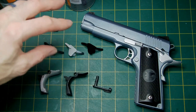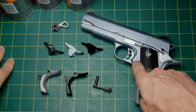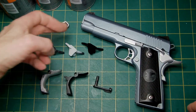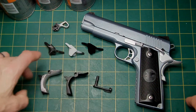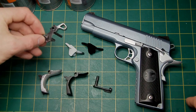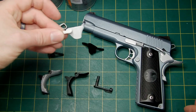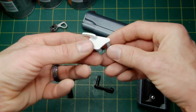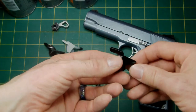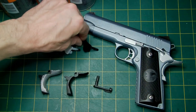So that's the three or four stages — including the polishing beforehand — to get to the finished painted stage. You can do it for any parts: trigger, mag catch, slide stop, thumb safety, grip safety, hammer, grip screws, barrel bushing — anything metal. All you do is sand it, leave it rough with a key. If parts are going to be black you can leave them black; if silver, take all the black paint off first and do a key. Then do a light coat of white undercoat or primer — grey or red will also work. Then do your top coat of silver, black, or whatever colour, and finish with a coat of clear lacquer. And it should come up nicely.